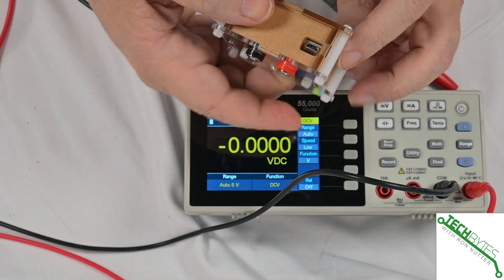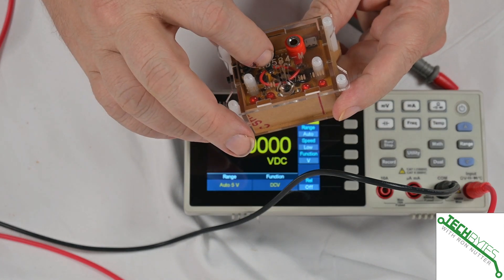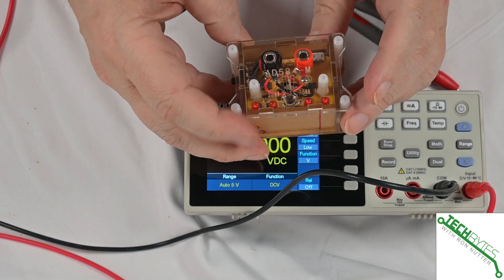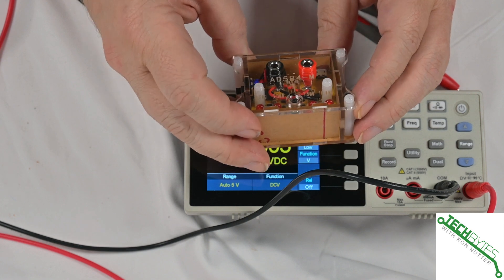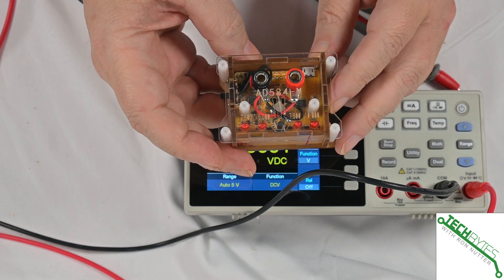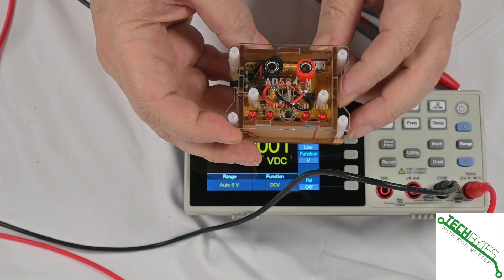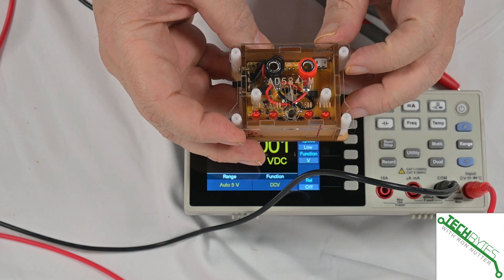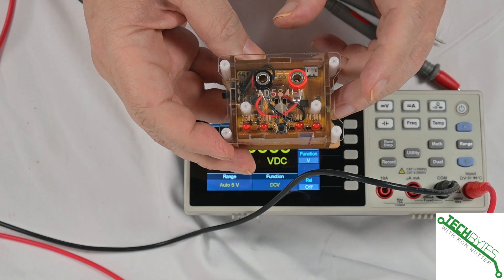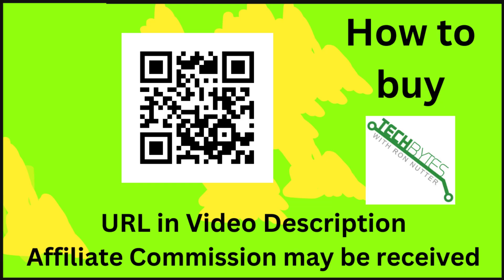At some point I'll probably remove the paper because, like you, if I've got a clear case I want to see what's going on inside. If you really want to get into the weeds, there is a circuit inside — the AD584 — and you can look up the spec sheets on that to really see what's going on. This is a very versatile piece of test equipment. You may not need it that often, but it's nice to do a periodic check. It's going to let you know when you have a device that may need to get recalibrated, or depending on the cost, it may just be easier to replace it. And if you're looking at something new, this will help you know how accurate it is and what to be prepared for in case of any drift. Take a look at this — I think you'll be very happy with it.